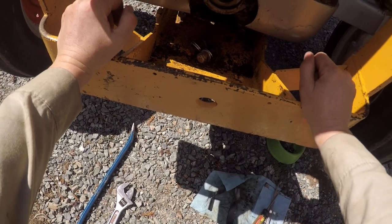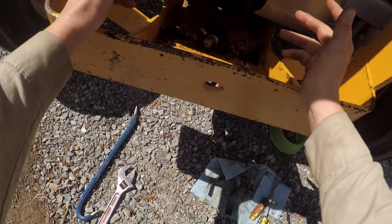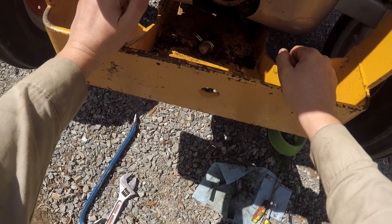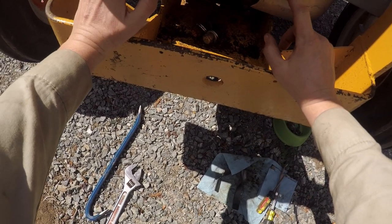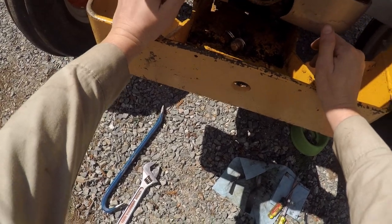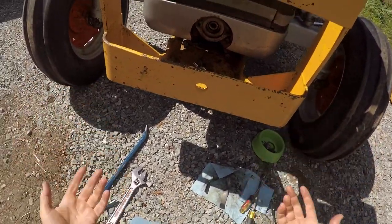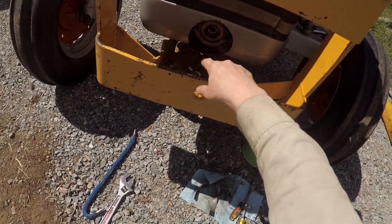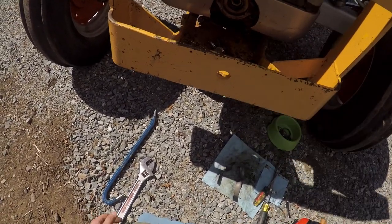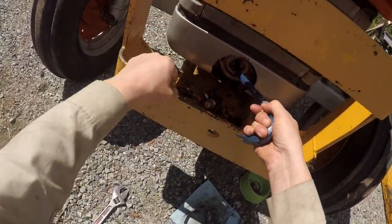I think the only thing to do is to get this front housing off. And maybe grab it with some vice grips, something. Or take the pulley adapter off, pop out the rubber bushings so they don't melt. Probably should be checked anyway. And then apply some heat. Maybe I had the tractor in gear with the brakes on, and I was moving it back and forth, so I don't know. Probably when that key spun, it tightened that on really, really tight. Oh, I also shaved down the ends of this crowbar and stuck that in and got the wrench on that. Nothing.